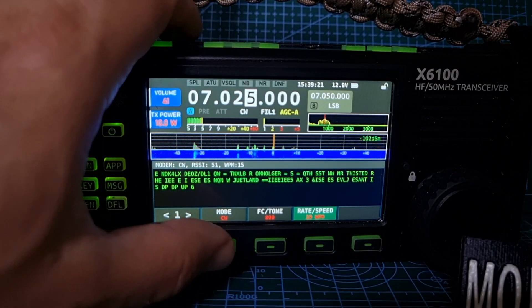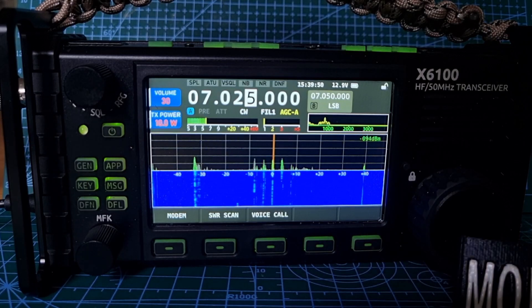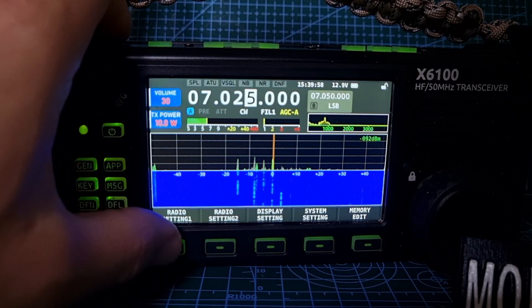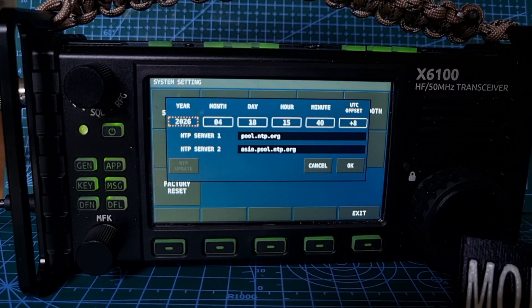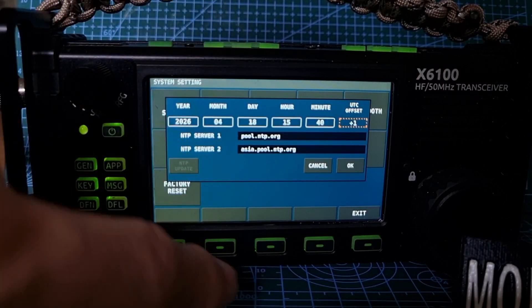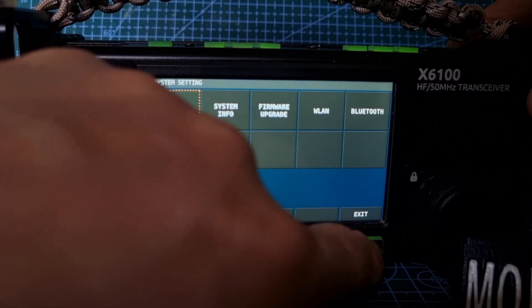Let's exit that. You've also got CW, BPSK, and RTTY available. Come out of the app. Number three is: fix the bug of incorrect UTC offset time zone. Go to Menu, General, System Settings, Time Setting — let's hit that. UTC offset is here — you just turn the MFK. England at the moment is plus one, so we'll hit that and exit out. Looks okay — click OK before exiting, then exit. That seems fine.